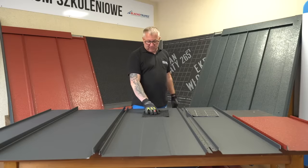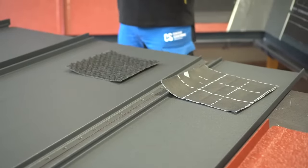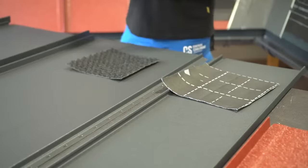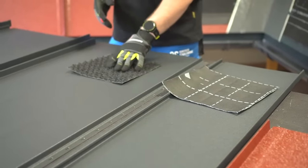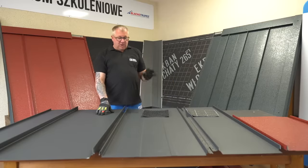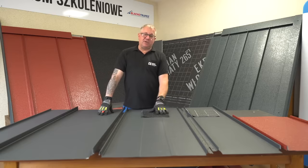The metal carpet not only takes care of any condensation issues but also allows much more movement in the sub-roof structure, as well as levelling out minor mistakes in the underlying boarded surface. This is important if the roof is constructed with many hips, dormers and valleys, and wherever builders cannot guarantee a steady level surface in their build-up. Another advantage of these membranes is their soundproofing capabilities, which will lower any noise coming from the metal in heavy rain.